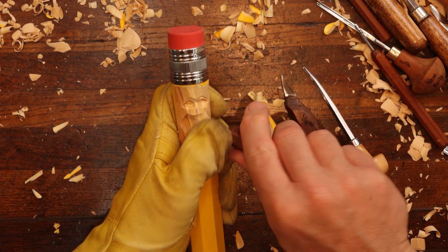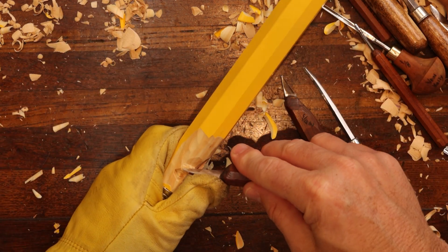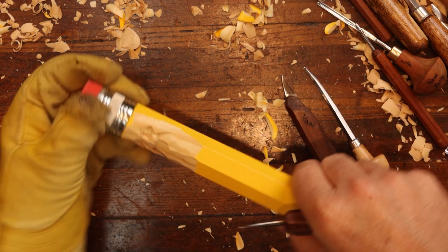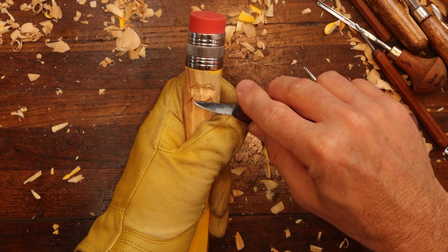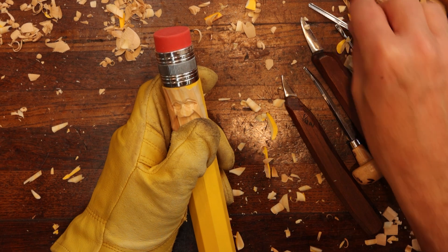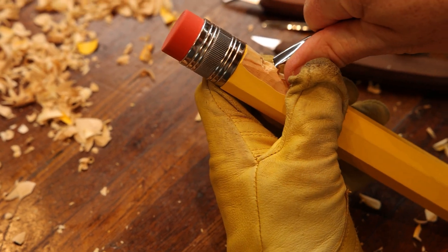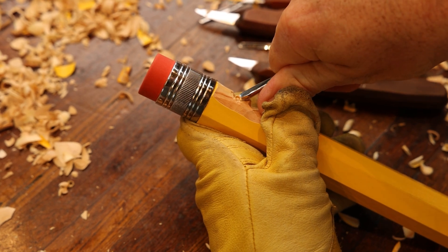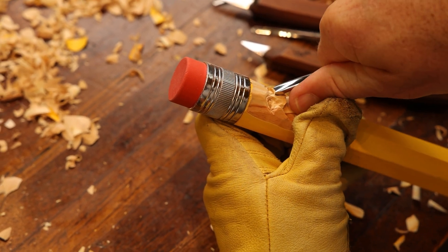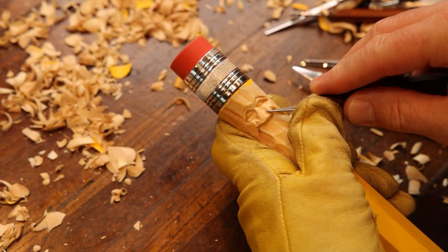Let's come in here and tweak this nose some, or we can move on to the beard. Now we're going to take this number five gouge here. I'm going to go with a soft V and come about halfway down and walk it in, because I'm afraid if I push too hard the grain is going to give away. So I'm going to walk my way in — you're going to leave a little jitter there, little cuts, but that's all right. We can smooth those out after a while.